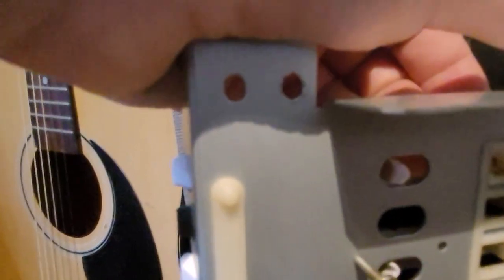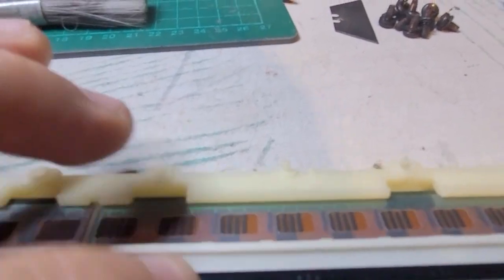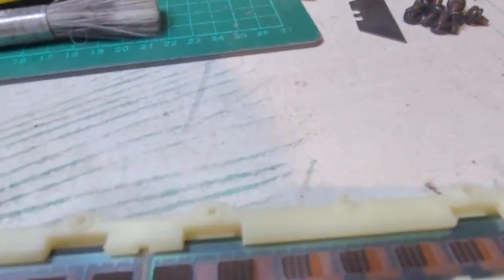So the keyboard. If you look here, the way this works is when you press a key, there's a little thing that comes down and presses on a rubber membrane. So every key has those, and as you can see, they're surprisingly sharp. I thought it'd be round, but they have that V shape, and essentially they press onto this, and because of the shape of this, it pushes this little conductive thing, maybe carbon, something like that, that actually bridges, let me zoom, these guys here.